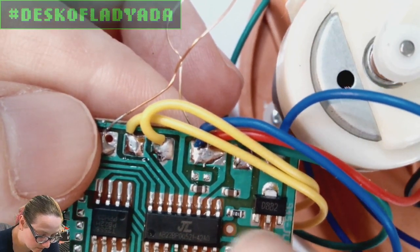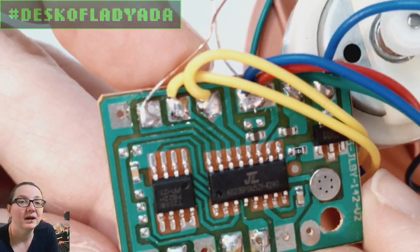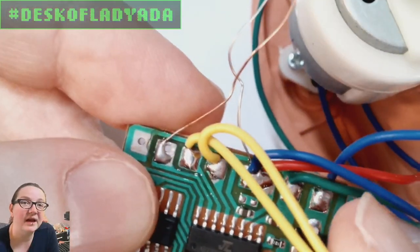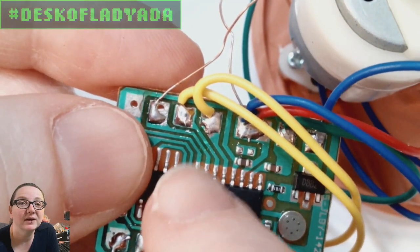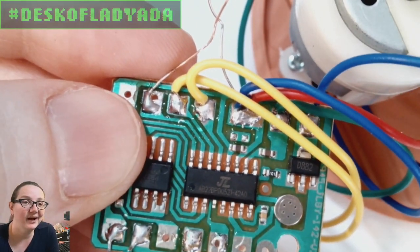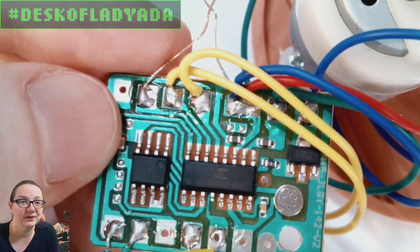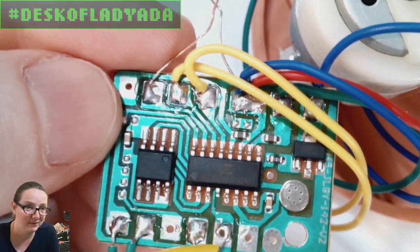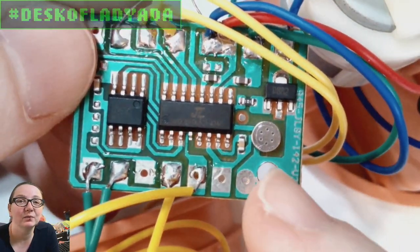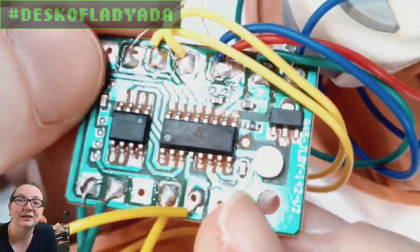There's one capacitor and one resistor here - actually this is probably a BJT not a MOSFET because there's an inline 100 ohm resistor. These enameled wires go to the LEDs. This yellow set is the speaker - both wires go directly into the chip and there's no separate amplifier. This is a chip with a built-in Class AB or Class D amplifier that can drive an 8 ohm speaker. This is a specialized audio chip, because it has a built-in speaker driver for an 8 ohm quarter-watt speaker and also a microphone input.